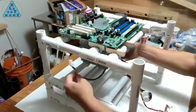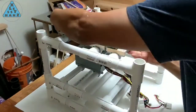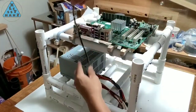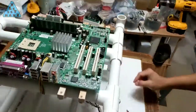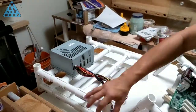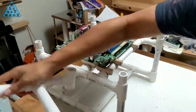Now I need to see where I'll run the power cables from the PSU to the motherboard. One thing I had forgotten was that the PSU has two cables to the motherboard and both connections are on almost opposite sides of the motherboard. The ability to rotate any of the levels 360 degrees can be a useful feature. This is where the extremely flexible design of this case shines and allows me to find a configuration that allows both cables to be connected. One last feature I want to demonstrate is the ability to swap levels between each other — as long as the cables and hoses are of adequate length, any level should swap easily with another. I plan to put the motherboard on top, the PSU and drives in the middle, and the water systems on the bottom.